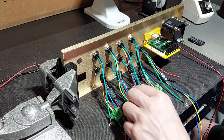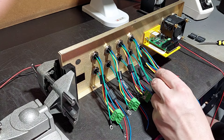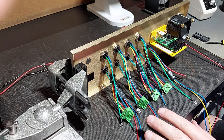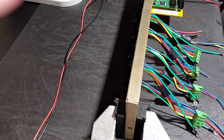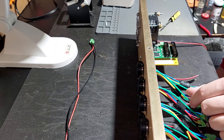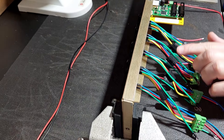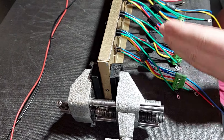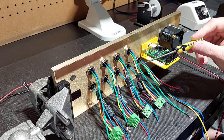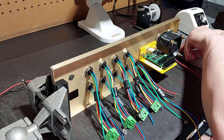Why do I always use silicone? Because of the flexibility. If you ever service your system and start manipulating things, you typically want to stay with silicone leads because everything is very easy to manipulate — especially since I've already wired the connectors outside of the enclosure. That's why you like having an enclosure that completely breaks down. You don't have to worry about double-shielded cable inside the enclosure because we have passive filtration with our ferrites.